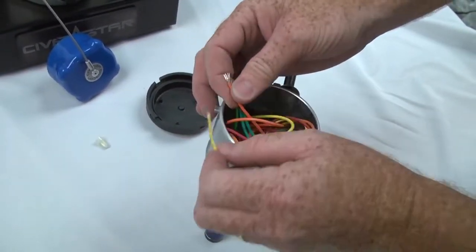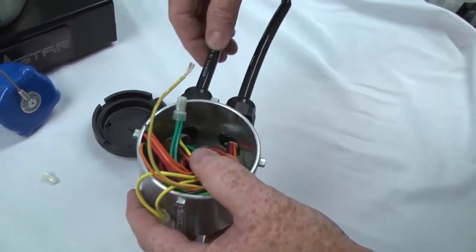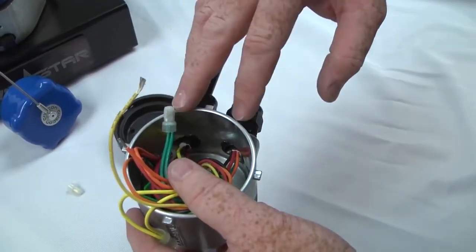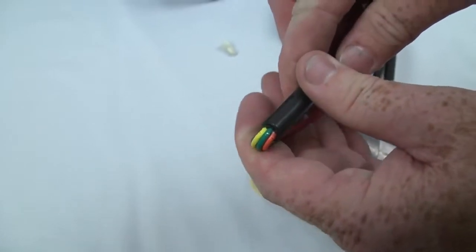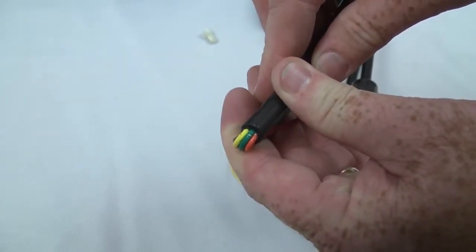It appeared to be crimped, but they pull apart and that could be causing your fault. Also pay close attention to where the outer cabling is stripped off of each wire where it goes through the strain relief fittings — at each probe housing and at the socket itself. If the outer casing is improperly stripped, the inner wires can be nicked, allowing a place for moisture to get in and corrosion to form.